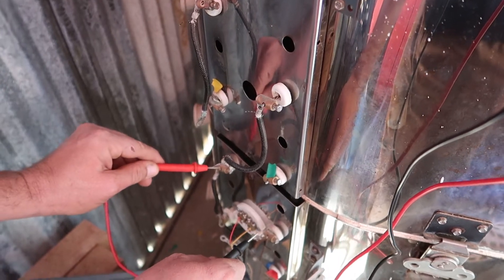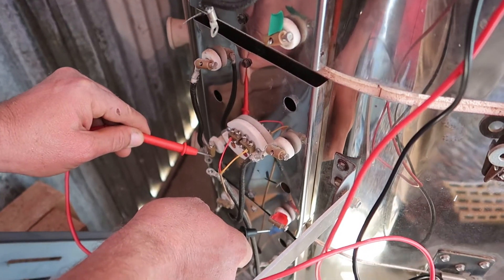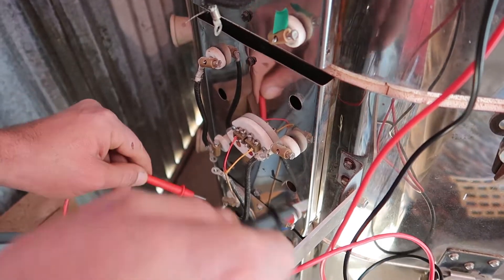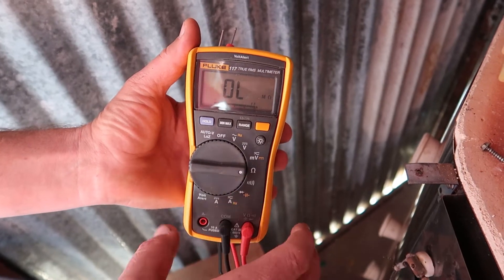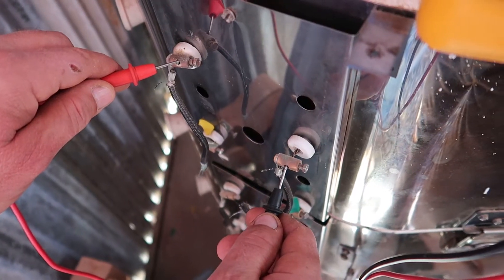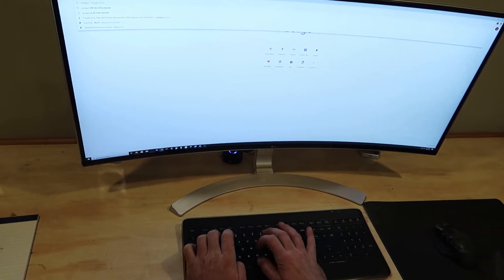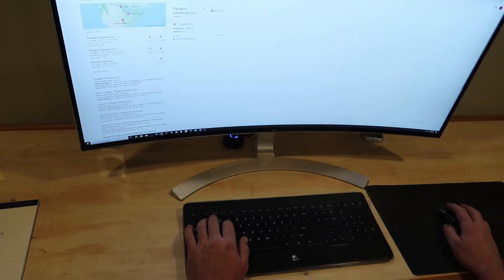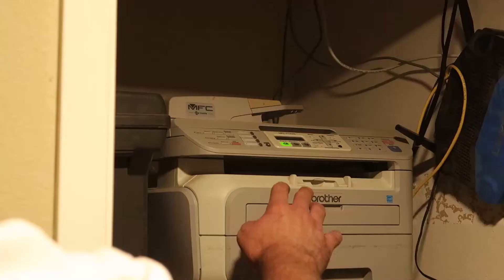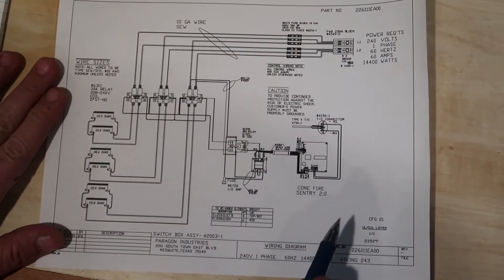Once you know that your kiln element is not broken, the next question should be: how do I know if it's worn out? Is there a test I can do? The answer is yes. You want to check the resistance with an ohm reading. How do you know the resistance of your heating element is actually quite simple — if you go to the manufacturer of your kiln, you should be able to download the electrical schematics, and they'll show you the original factory ohm reading that you need to get. That's the amount of resistance in the wire.